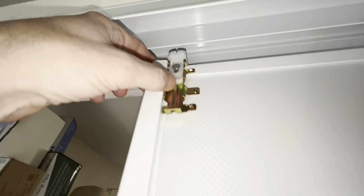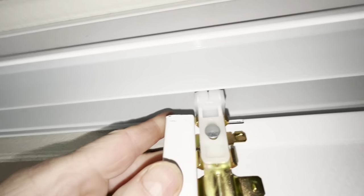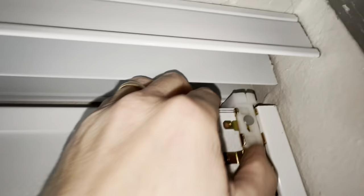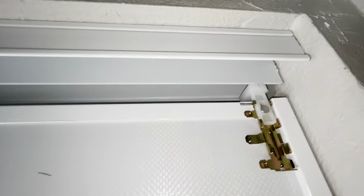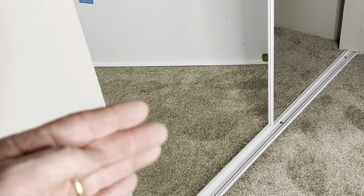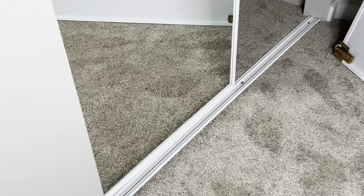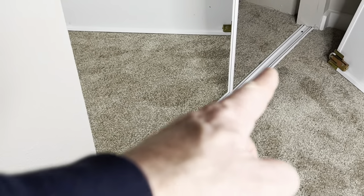Here's the other adjustment: you can take these and just push them all the way up — do the same thing on the other side. That's a nice extra adjustment. Now we've got the one door on. You can put it on the front track or the back — it doesn't matter because they're interchangeable. You can put that one closed and put the other one on the left side. Now we'll go ahead and put the second one on the front track.